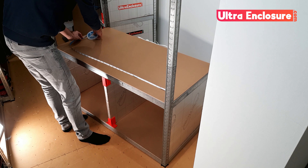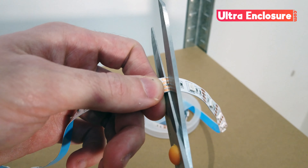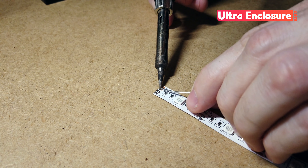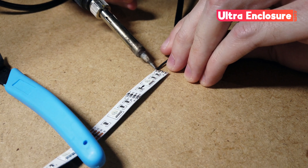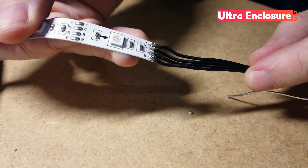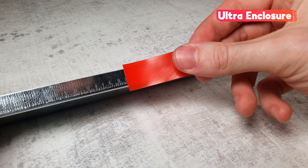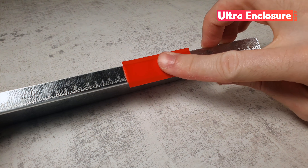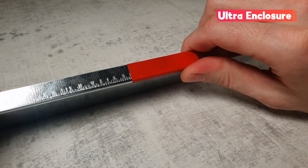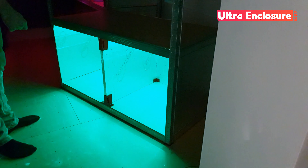Now if you want to install LEDs this is an ideal time to do it. Measure out the width of the shelf and cut the LED tape at a marked point, cutting from the end closest to the power cable. We can now take some wire of an appropriate gauge and solder it onto the pads at the other end, leaving plenty of extra to extend and connect it to the next strip a little later. You can now peel and stick the LED tape to the underside of the shelf. It's also a good idea to insulate any metal the LEDs may touch to avoid any shorts — just add some electrical tape at these points. Flip the board over and drop it into place. We're now ready to move to the next level.